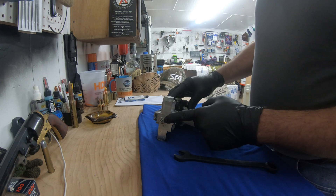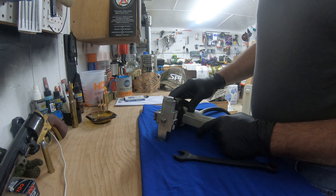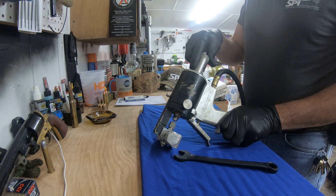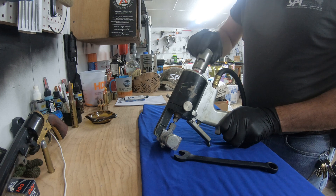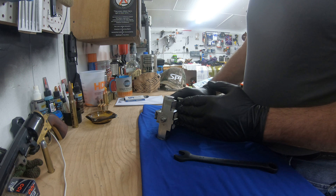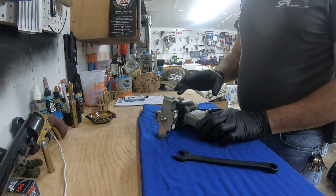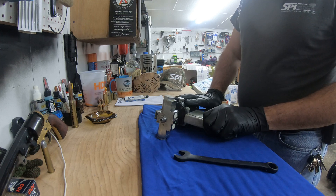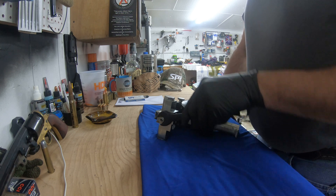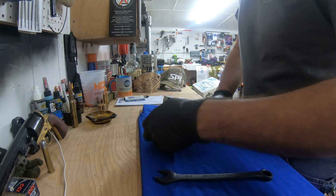The proper way to remove the chamber or module — whichever word you prefer — is to take the safety stop button on the back of the gun and put it to the spray position, because I want full rearward travel of the valving rod. With the gun connected to air, I'm going to depress the trigger.